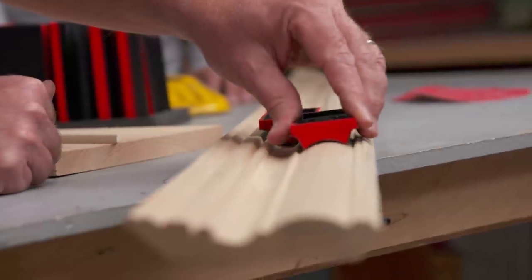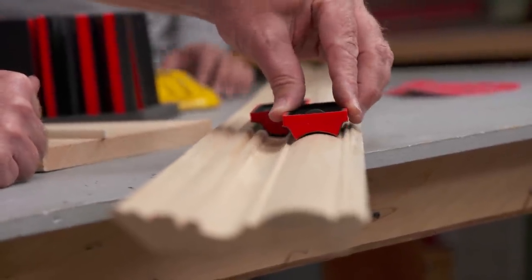I always carry this little flat one with me and it's great. You can see when I push it, I can get a lot of leverage on it and get a nice even sand. If I try to fold this over in my hand and do it, I'm just going to get a pressure point right down the middle. So you're going to get some uneven sanding right there, and certainly that's going to be exacerbated when you're trying to get into a profile like this. It's a nice kit — I'm excited to bring it to the job site.